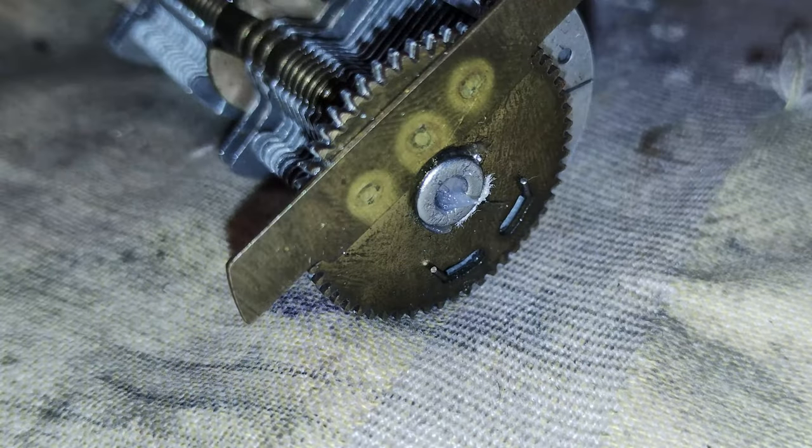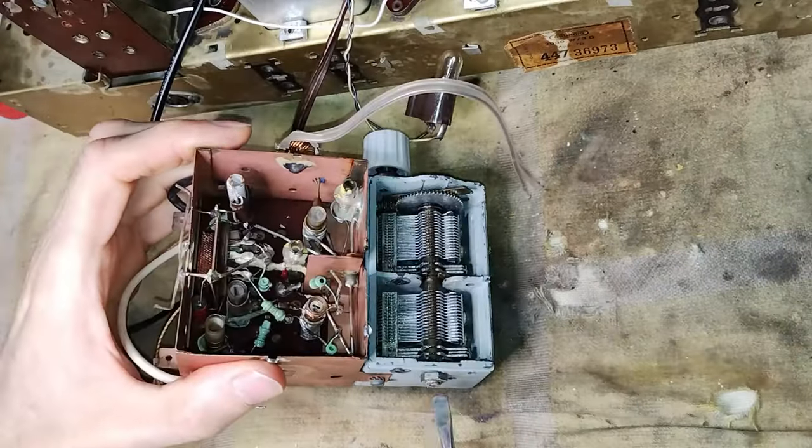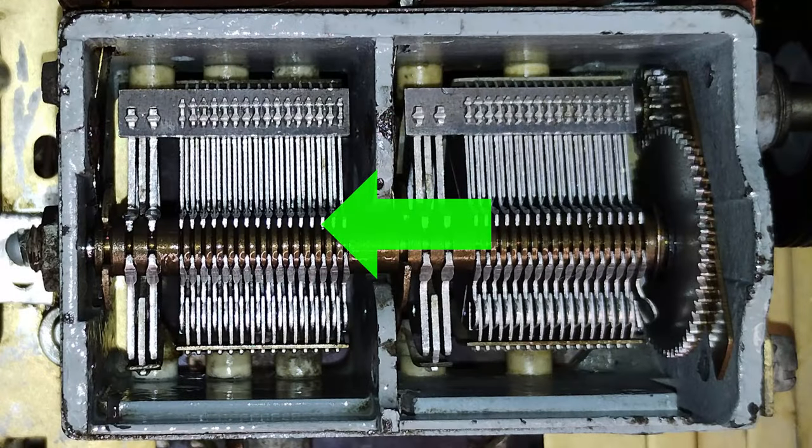The small washer that was used was much thicker than that, and with such new parameters, it wasn't even possible to put the rotor back in place. However, after removing the spacer, some residues of hardened superglue were making the wanted backward pressure that could finally be adjusted.